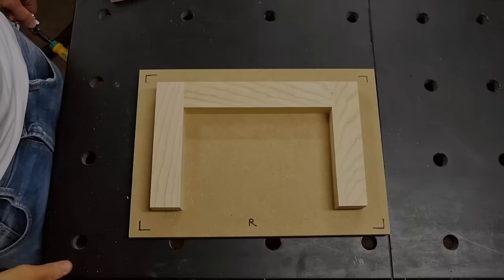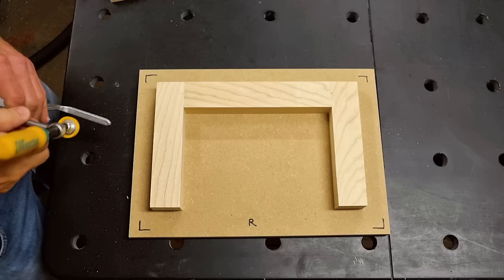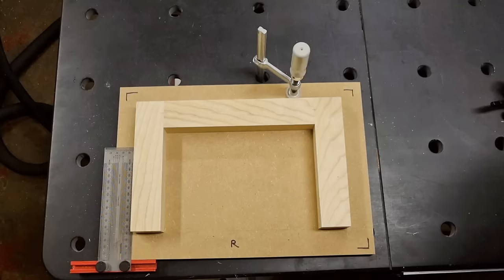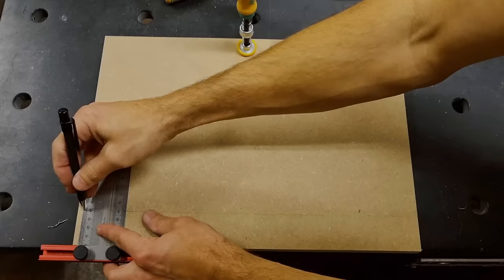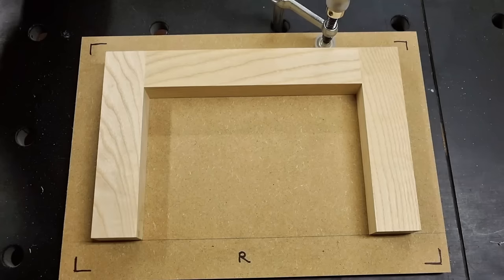For more complex template shapes, it's a good habit to have square corners on all sides of the template. The template is slightly oversized compared to my workpiece so it isn't too flimsy when I cut most of it away — but you can't make it too oversized or you won't reach with the side clamps, so check with the clamps before deciding the template size. I also left some extra distance for a starting distance later on at the router table.